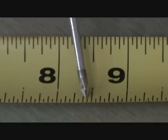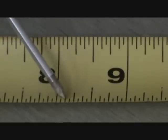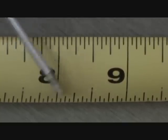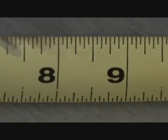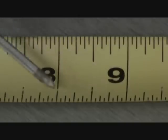So that would be seven-sixteenths, because eight-sixteenths would be a half. And if you get mixed up with that, you can always count these back: one, two, three, four, five, six, seven — so that would be eight and seven-sixteenths. It's going to take a while to get used to, but that's how most tape measures are marked.